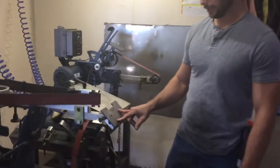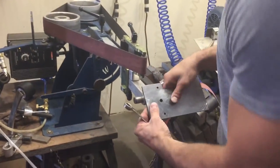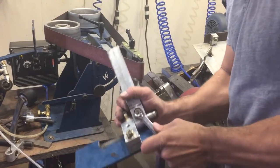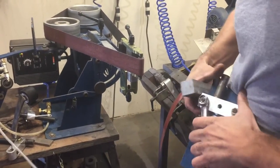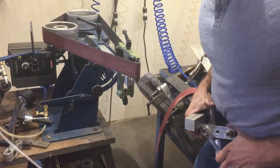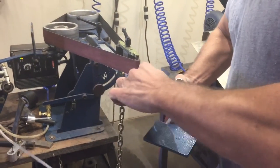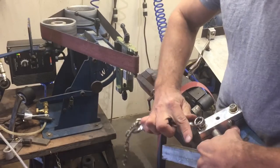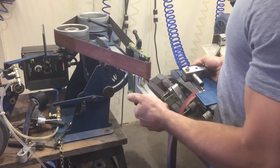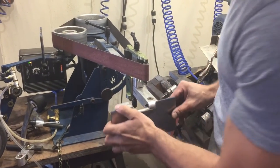You can see, coming in here a little bit, that we're nowhere near being centered on this. Because what we're going to do — I really tightened that — is loosen some stuff and reconfigure this. I'm going to shift my dowel pin over to the center of the work rest, and this is going to allow me to get a lot more centered on my small wheel, because the dowel pin goes towards the center.